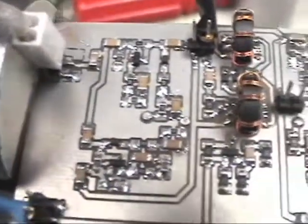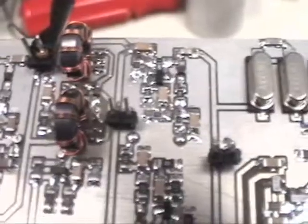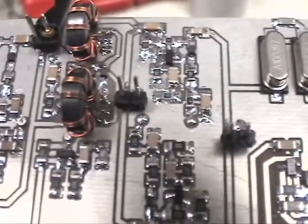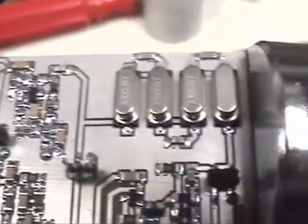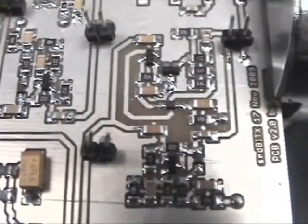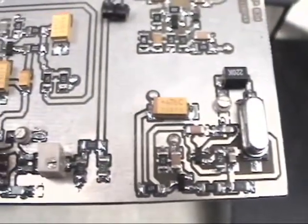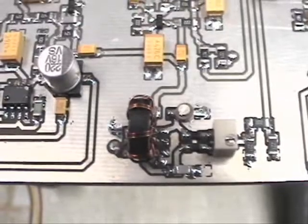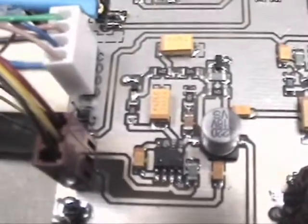There's the RF amplifier going into the mixer and VFO amplifier. Coming in there — in the middle is the first IF. Receive on top, transmit on bottom. Crystal filter, down to the second IF — transmit and receive. There's the BFO. The balance modulator with its adjustment resistor and capacitor. Microphone amplifier and audio amplifier.